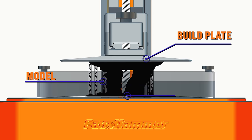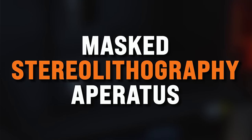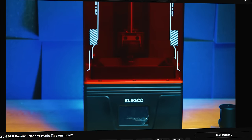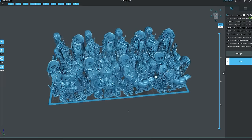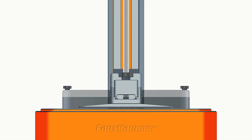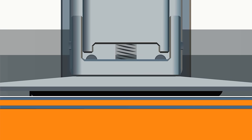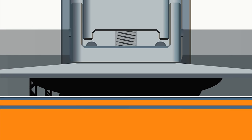After a layer is cured, it is fused to both the bed or previous layer and the release film. This is when you're using an LCD printer, referred to as Masked Stereolithography Apparatus or MSLA. You also have more traditional SLA which uses lasers, and DLP printers which use projectors instead of LCD panels — but due to price, these types are much rarer and everybody uses LCD. Your models technically print upside down from how you viewed them in the slicer, because the bed lowers into the liquid resin rather than something being printed up from a bed.